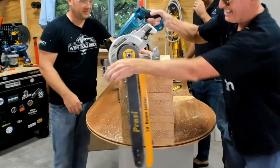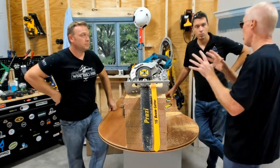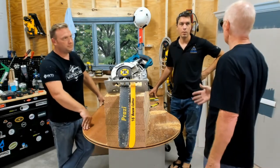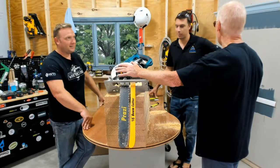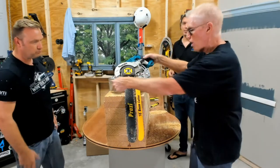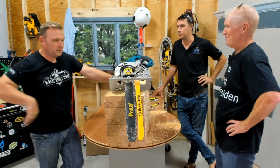Woo! Awesome! Now this is actually a nice showdown for Makita too, because look — we cut all this. How many more cuts are there? I can go almost an entire busy trade show day with these two 18-volt batteries. When they came out with the cordless, at trade shows it saves me a lot of money because I don't have to hire electricity anymore — I've got charged batteries. At trade shows they charge you $300 for power. Nice, clean, level cuts guys. You'll get a little fringe on top if the wood is dry, but a lot of guys will just score a line with a razor blade first and you don't get any fringing at the top. For rough construction that part doesn't matter.